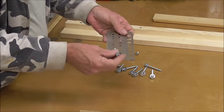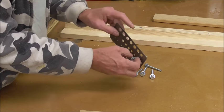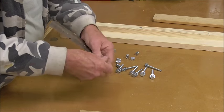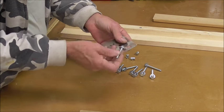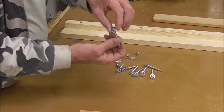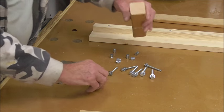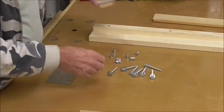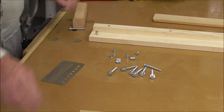So we've got a 6 bolt there, which will drill the hole through from that, but then also we need to clear that halfpenny washer. So put a portion of it on that, 13. So that's going to be 15. And a portion of it on there. There's the leg. Now, as I said, I want to come in at least 20mm. So I want to be there.